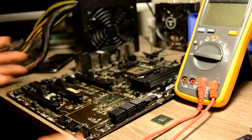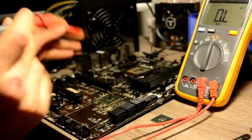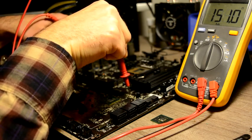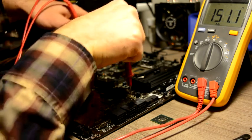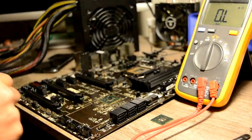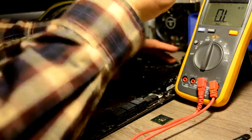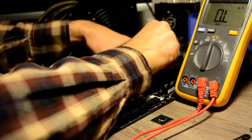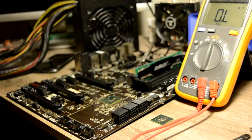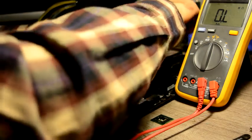Right now I just want to plug in and see if it works. We won't go over all lines — let's at least check our line to the hub. On our hub we have 150 ohms — yeah, that works. Let's plug everything in. We won't plug a video card because this type of processor supports integrated graphics, so we will connect our screen straight from the motherboard.